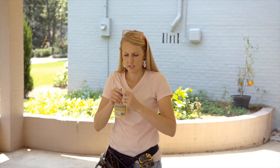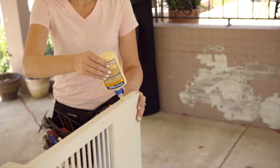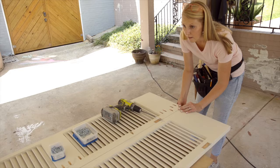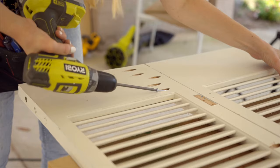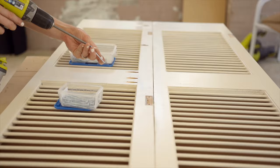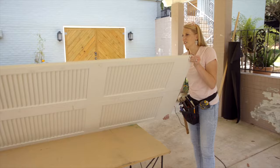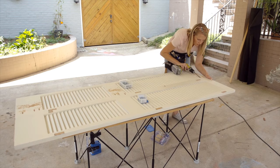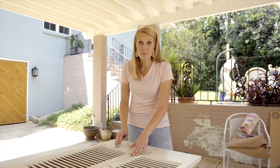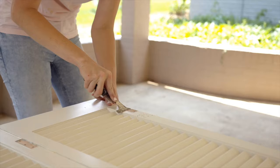I'm going to add some wood glue between the two doors and then attach them with the pocket hole screws that have flat heads — you use a special drill bit to attach them. Once joined, we'll scrape some of the old paint, putty the holes and the pocket holes, and get everything 100% ready for paint.